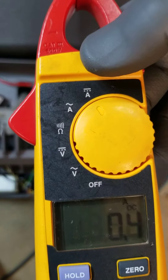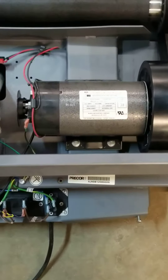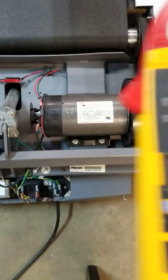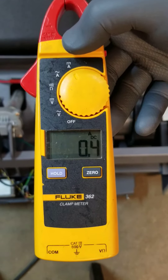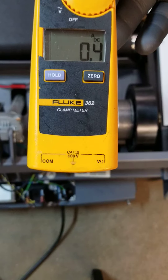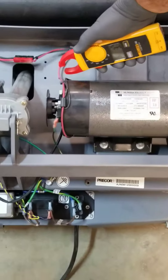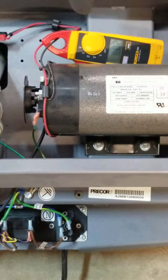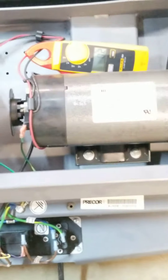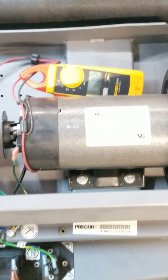and then a straight line for DC, because if you look down here, we've got a DC motor. So I've got this thing turned on, set, ready to go. We're using the clamping mechanism, so we don't need the leads. I'm going to clamp around the black wire on this — only one. If you clamp around both of them, they'll cancel each other out and you're going to get pretty much a zero value.